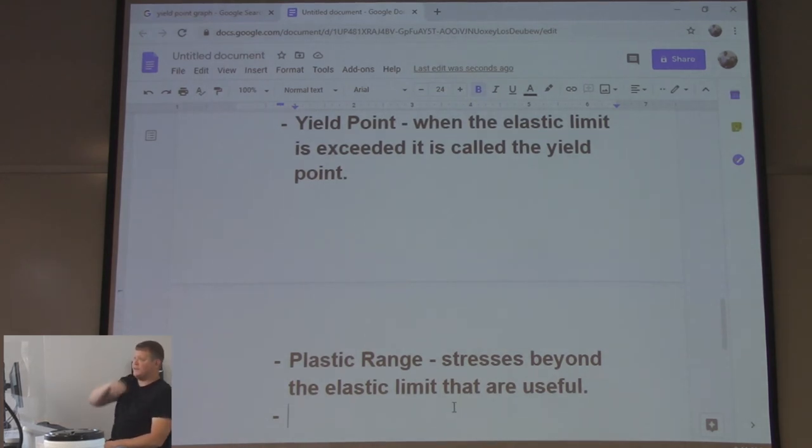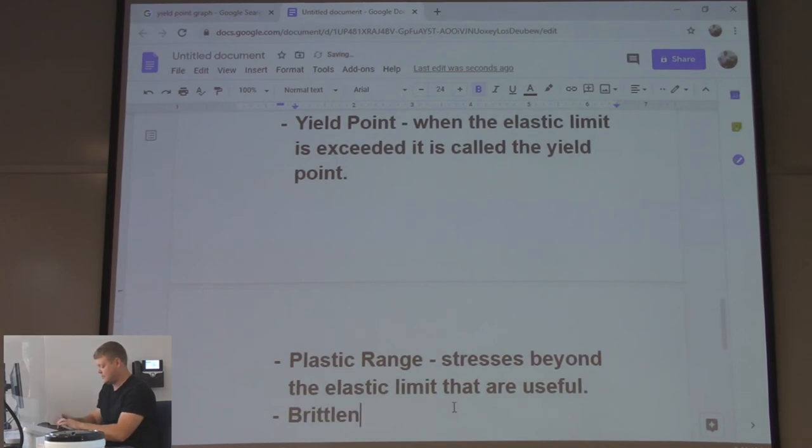Anybody ever break a piece of fence wire? You bend it back and forth and bend it and bend it, and then eventually it breaks. It takes a while, doesn't it? The reason that it breaks is because every time you bend it, you're squishing one side, work hardening it. Then you're work hardening the other side. With hardness comes what? Brittleness. That's the next thing we got. As you're hardening that, it's getting brittle, and eventually it breaks. It gets hot too, right? Burn your fingers. Put that energy into it.